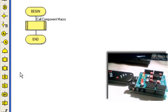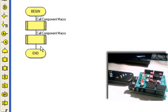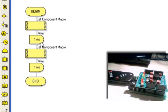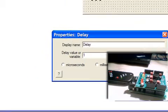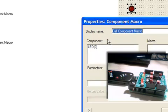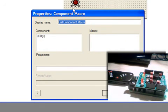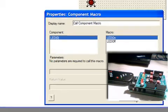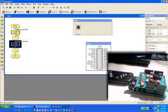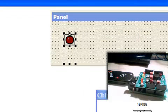We're going to come over to our macro, turn on the LED, turn it off, and add a delay in between. We drag in a delay — one millisecond is pretty quick, so let's change that to seconds. You can see how easy it is to do this in Flow Code just by clicking. LED zero will show up in the component panel — we click it and turn it on, then select that component and turn it off. Since there's no loop, it'll just run through the program once from beginning to end. Let's run the simulator — it turns on, turns off, and the simulation is complete.